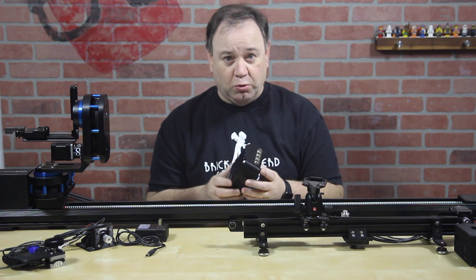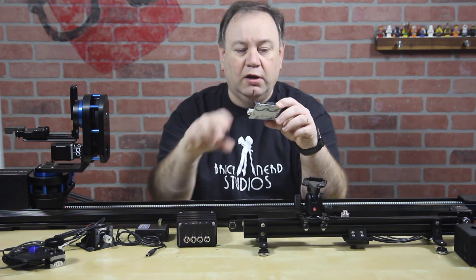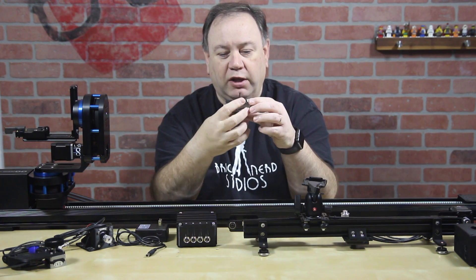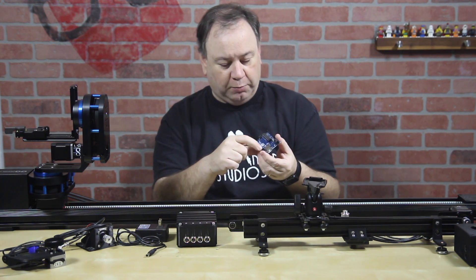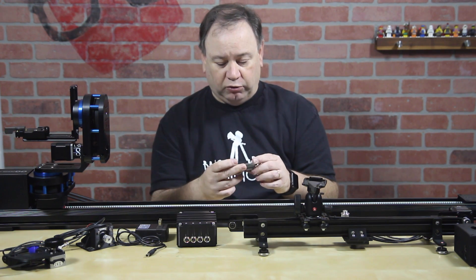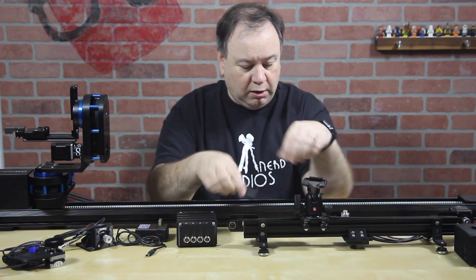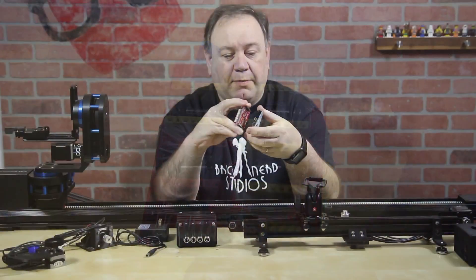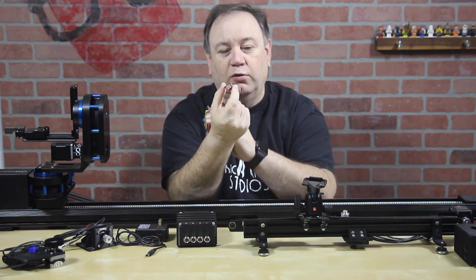What I'm doing here is actually nothing new or groundbreaking. It's just my way of packaging existing technology. How it works is inside here there is one of these. This is an Arduino — an Arduino Uno. This is a microcontroller and really all it is, is a very open and flexible way of controlling things. All these little pins here on the side are either in or out and either analog or digital, on-off or they can be controlled through PWM — pulse-width modulation. This is what actually connects to the computer through the USB. And this is what you call the shield.